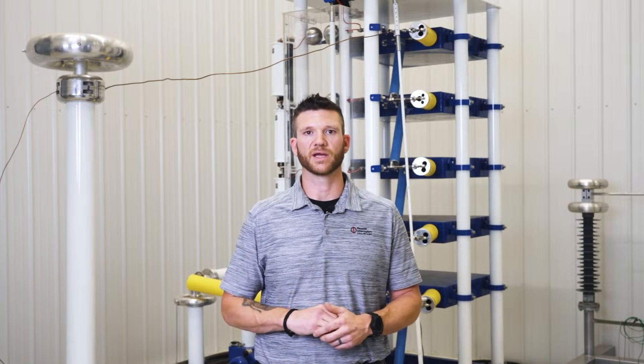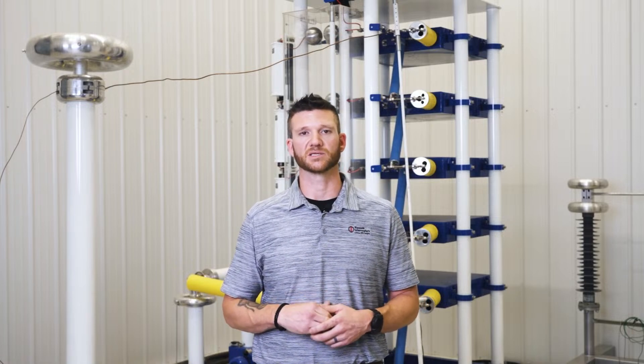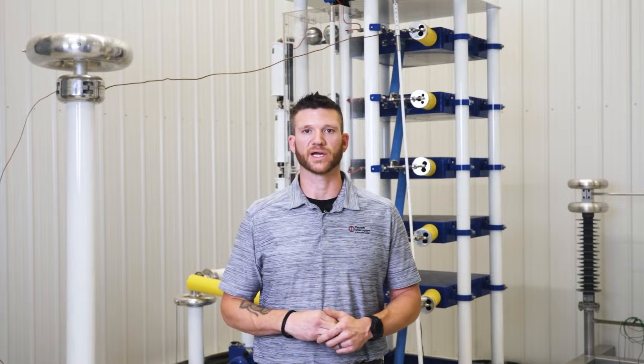Some of the things you can find by simply timing the contacts on your breaker: you're going to be looking at the open and closing speeds of your breaker. With that information, if it's opening too slow, it could be drawing the arc too much and therefore damaging the contacts. You also want it to close within the manufacturer spec time. Timing can also indicate whether the mechanism is getting slow — whether it's just old and worn out, or the lubrication is getting gummed up.